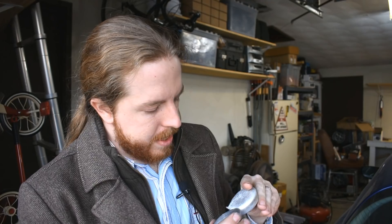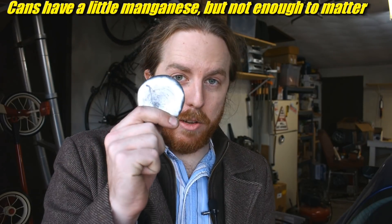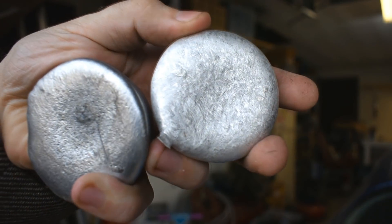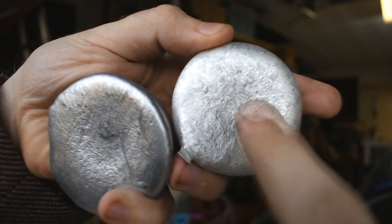The first one I'm going to do is aluminum bronze, and I'm going to alloy it with this one — pure aluminum, mostly from cans. Cans and extrusions give you pure aluminum. This other ingot is cast aluminum, which contains a lot of silicon. The pure one is a lot brighter in color. Also, with the pure aluminum you get these cool crystals and a lot more shrinkage. Because of the crystals and shrinkage, pure aluminum is not very good to cast with. But it is good to alloy with, because cast aluminum can introduce silicon, and I don't want silicon in my aluminum bronze.